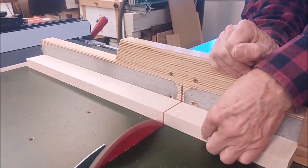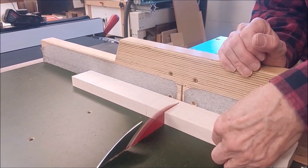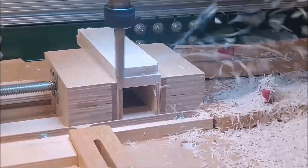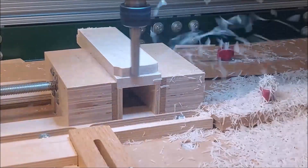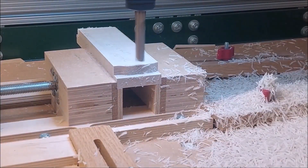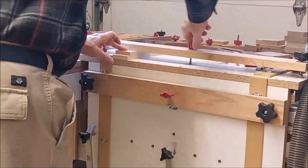Turning to the drawers now, we're cutting the drawer fronts on the table saw to final length. My shop-built CNC vise is used to hold the drawer fronts while rabbets are cut on the ends of the drawer fronts using the CNC router. You can see the making of the vise in another video on my channel. Here we're clamping the drawer fronts in a fixture that will hold the fronts while we're cutting the pin sockets for the drawers.